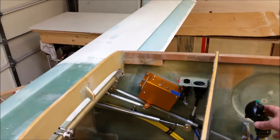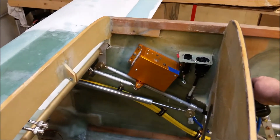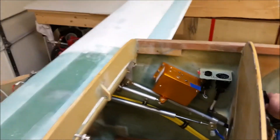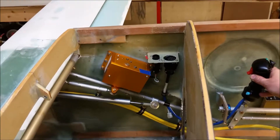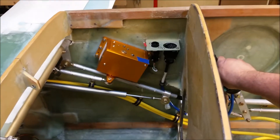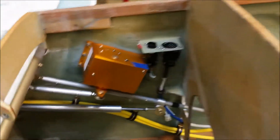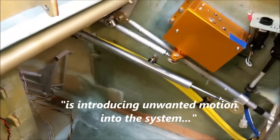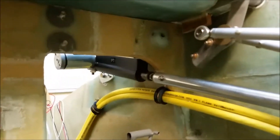I'm going to try to get this into view — that's not too bad. Now watch where the pitch trim actuator attaches to the elevator control tube. When I pull this back, see how that shifts. Forward isn't bad, but when I come back on the stick that shifts, and I'm sure that shifting motion is going to be motion lost. I have auto trim with my Trio autopilot — you can see some of this from this angle down here.